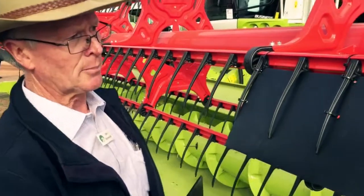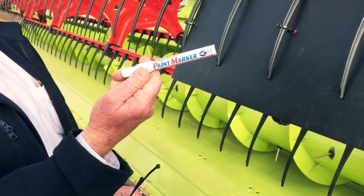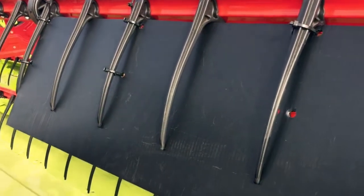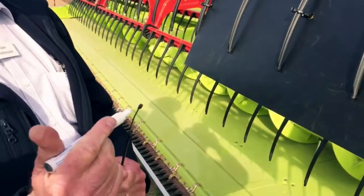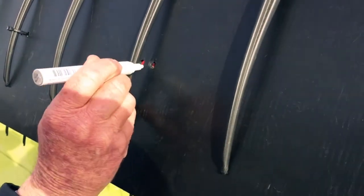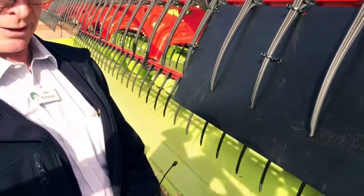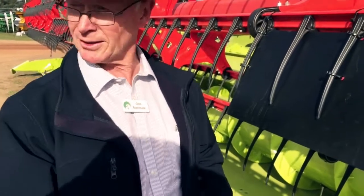So Glen, how do we attach the corflute to the reel? Okay, so the first thing you do is mark it. The best thing to mark black corflute is a white paint pen — you buy these at your local news agency. It's a paint pen, not a marker. The paint pen puts a nice little dot where you've got to mark it, giving you a lead-in of where to punch. Punching the hole is better than drilling it — drilling with plastic tends to tear, whereas punching it is nice and neat.